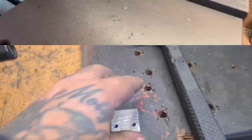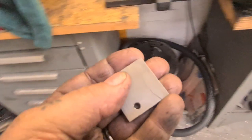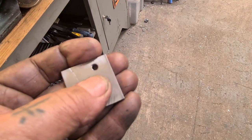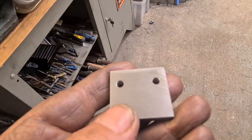We've finished it, though I'm struggling with focus again today. There's a little score where it picked up something during fly cutting, but a through pass has given me a lovely finish. I did have to hone the tip a little bit, and I've drilled through and countersunk. So we'll get that fitted and that's that one done.